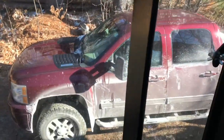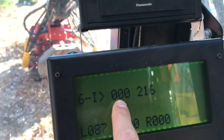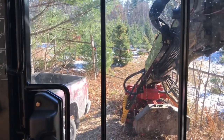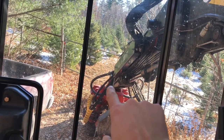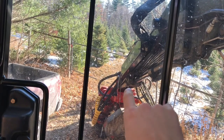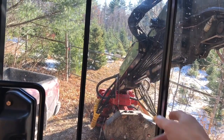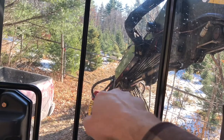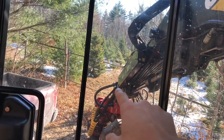Well, I'm back. As you can see, I'm out on the yard with the harvester because this is staying zero — that's my preset — but the measuring wheel is not working. I knew there was a wire that holds the wiring harness going through that hose, and right in there I think it got pinched. The measuring wheel had been acting funny, but if I turned the head too far this way and those hoses wrapped up, it would make the measuring wheel not work. If I turned it the other way and the hoses moved, it would be fine, and it was fine most of the time.